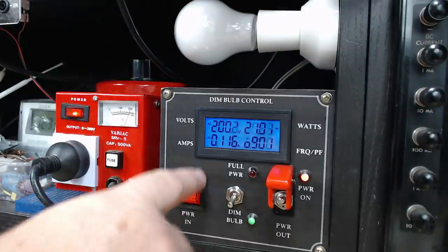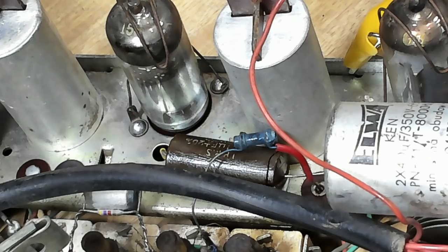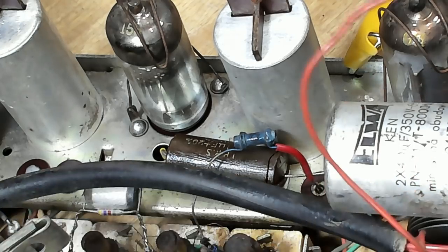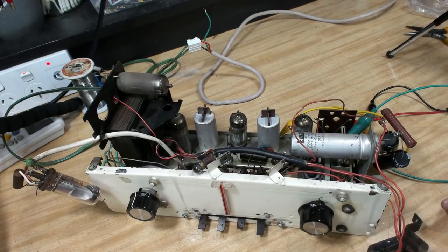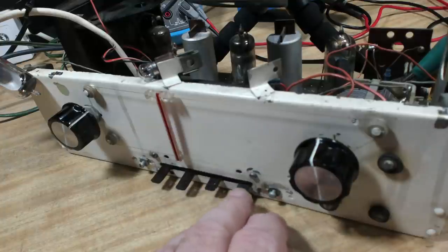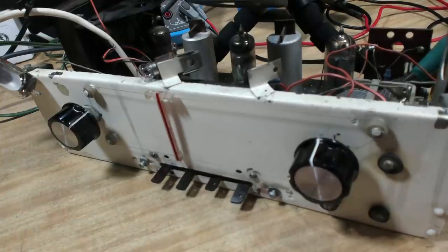After finishing filming the previous day, I realized I hadn't tested long wave and short wave. Long wave worked fine, medium wave worked, but short wave didn't work at all. From the way it was acting I knew the oscillator wasn't working. I watched Blitz's video again - he had it running on short wave - so I thought maybe I'd broken some wires when cleaning. I checked all the wires in there and cannot find anything wrong.